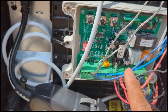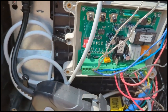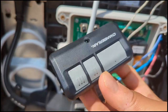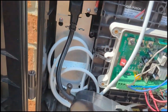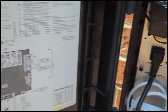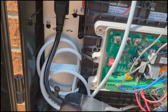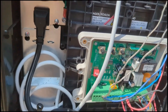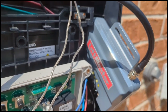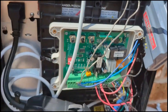The one part about this controller that I don't like is the fact that it only works with their proprietary remote controls — small keychain remotes. So you can't use a LiftMaster-type controller, which is what my LA400 obviously worked with. That's a huge problem. And most vehicles nowadays have Homelink built in, so you can't use Homelink with this either — it won't accept that. So in my next video, which follows this one, I'm going to talk about adding Homelink via this LA add-on receiver. The antenna is right out here, and I'll talk about how to wire that in.